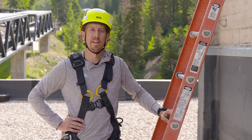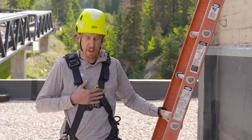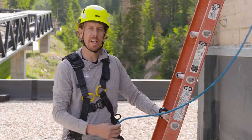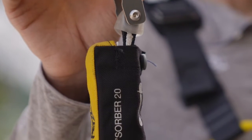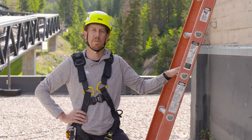Here at this resort work site I'm going to access my sloped roof using this portable ladder. I'm wearing a Newton full body harness and I'll be connecting to the Ray 11 millimeter rope using the ASAP lock and ASAP Zorber 20. Each of the components in this fall arrest system are compliant to ANSI for workers' weight up to 310 pounds.